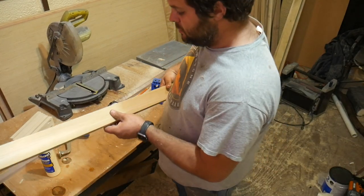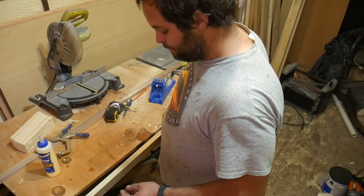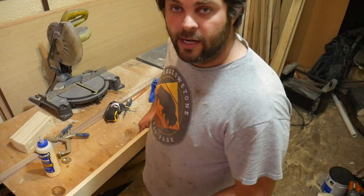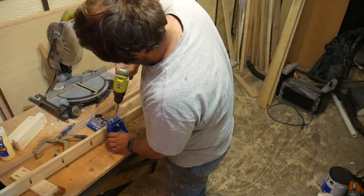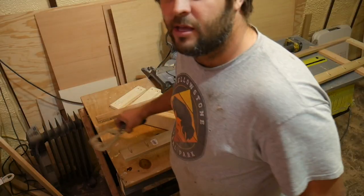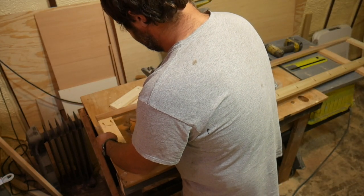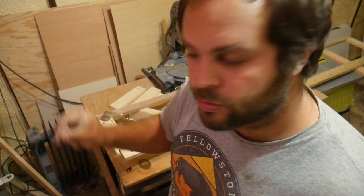So the top rail is going to be attached directly to the ceiling, and I'm going to do it the same way with the pocket hole screws. I don't want this thing to be able to twist or warp, and I want it to be relatively stout because it's going to be what effectively holds the cabinet up. So I'm going to drill a pocket hole every six inches down this board — it'll make a little bit more sense when I go put it in. I've also got this clamp that came in the kit — it's a really nice deal. You simply stick your board up here, clamp it down, and it squares those two boards up real nice and flat.